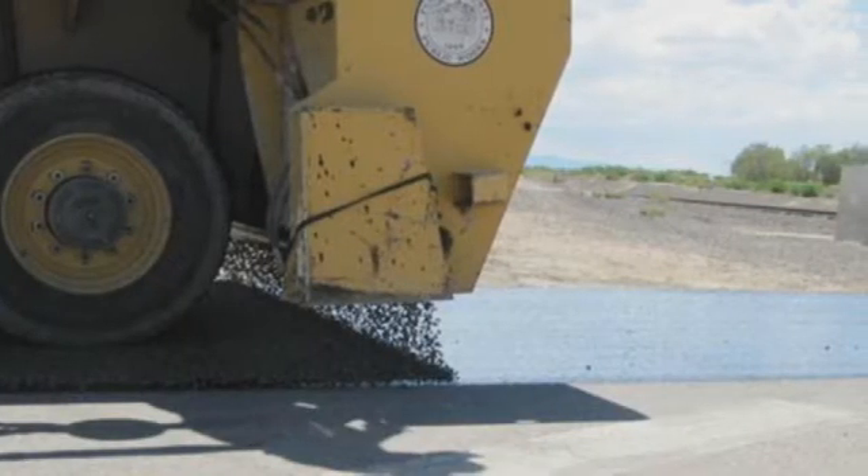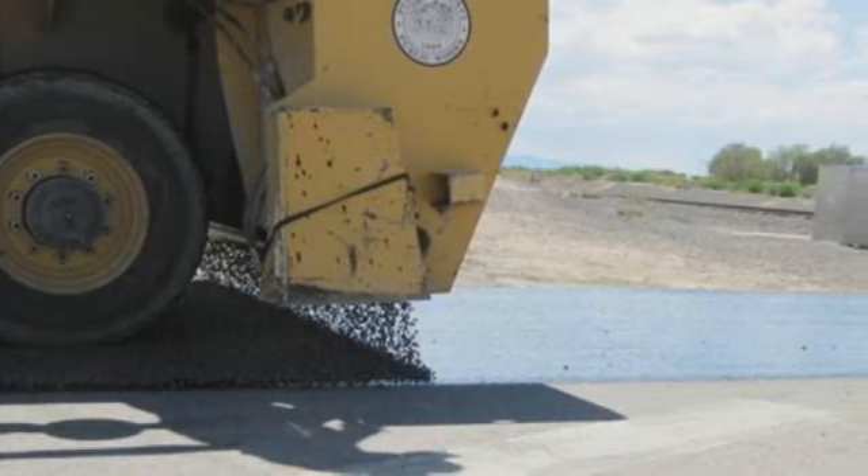The chippers, the first time they came out with the steel slag, they were just leaving their tailgates open too wide. When they closed the tailgates up and weren't trying to overload the machine, all they had to do was keep the belts full. They didn't need to have it building up in the front of the machine. Once they did that, the job went smooth after that.